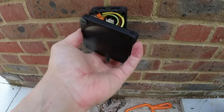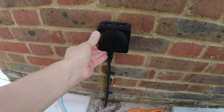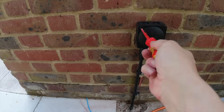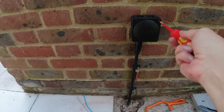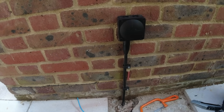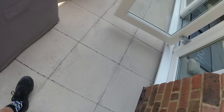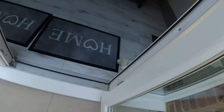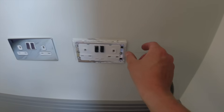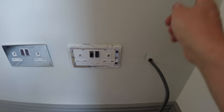Get it the right way - that way. And then I've got to go in and do a spur. Take you in there in a sec. James is wiping down all the trunking - it gets marked and stuff, that will all come off. There's a whisker. That's done. There's our feed cable. We're going to cut a spur in there - three inches to match these two. A spur off the ring, through a 13 amp fuse, feed this somewhere else.